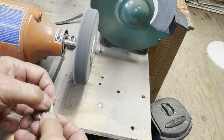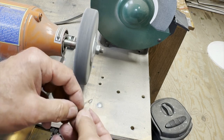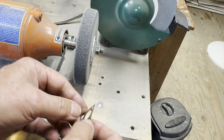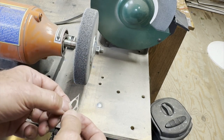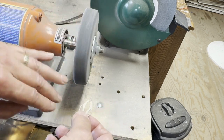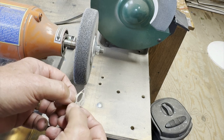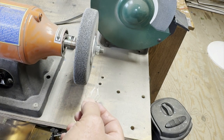One thing you're going to want to do is sand or lightly polish your titanium, because no matter how fast you go it's going to heat up and discolor. Getting the surface back to bare metal will improve predictability when you color it. I'm using a buffing wheel with a Scotch-Brite pad — you can use sandpaper, steel wool, or anything like that. It's just really easy.